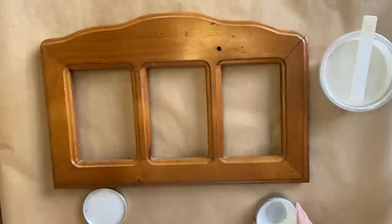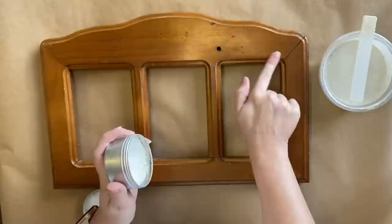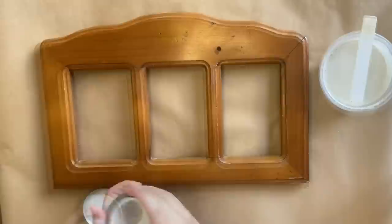You can use a little whisk for this. I'm then going to be using Dixie Belle's Best Dang Wax in Clear to create a little bit of resist. I want to be able to sand back the milk paint in certain areas, and by adding this wax it's going to make it a bit easier at the end.